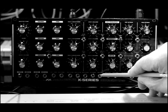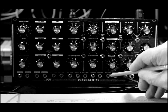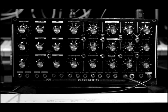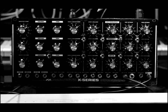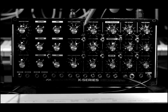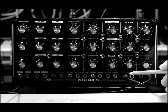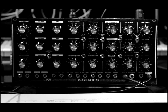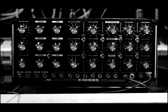Okay. The next is each oscillator has its own output. So we have VCO1 out, VCO2 out, VCO3 out. And these are pre-mixer. These are the basic waveforms being derived from the pole of the switch there. Plugged in here, I've got the function generator I mentioned. This is your VCF CV in, and you can control the filter frequency externally. There's a momentary switch here as well. That's a nice thing to have if you want to tap rhythms from the Micromac.